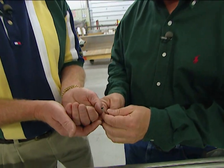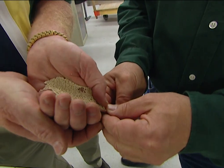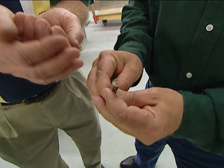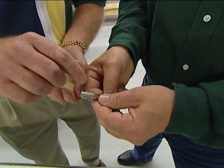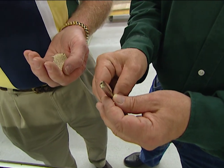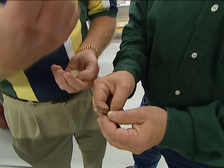The desiccant is placed inside the cavity of the spacer. The spacer breathes to the inside of the unit through very small holes in the welded seam, which allows it to absorb any moisture captured in the unit onto the surface of the desiccating material. So any moisture present during manufacture, or residual moisture that gets in, can be absorbed by these beads. That's correct.